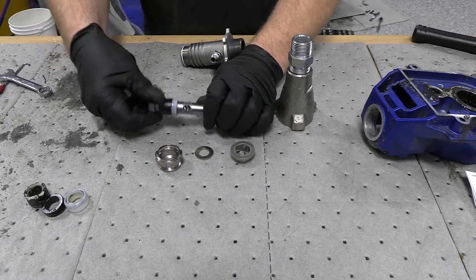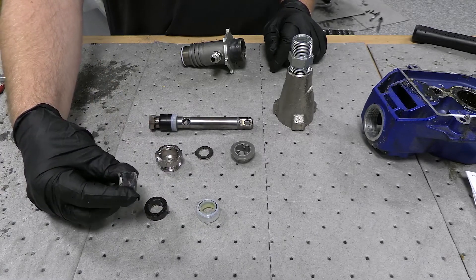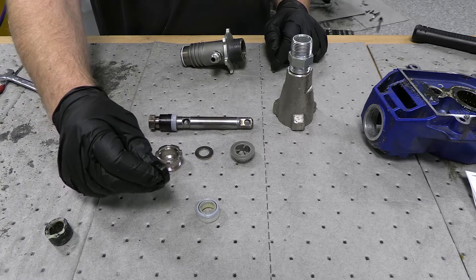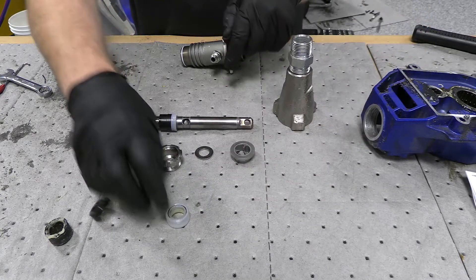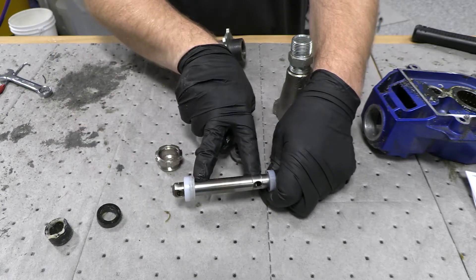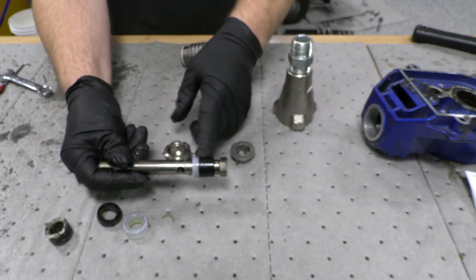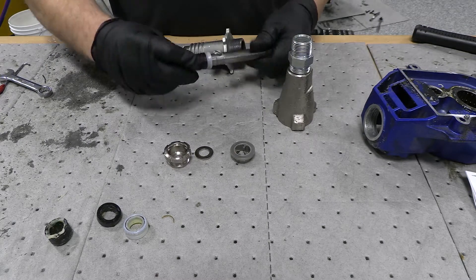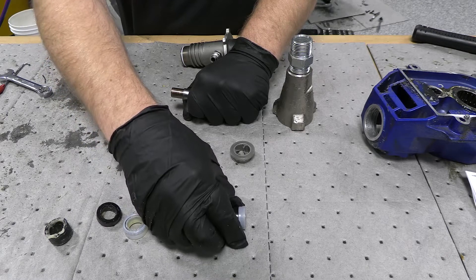Your biggest thing on these pumps is you have to watch how these packings go together. I've already pulled out all of these from the upper. These are the felt pieces — you can see those are not felt anymore, they're not soft at all, they're very, very hardened with ISO. Then you have a spacer that goes up there and then you have the upper U-cup. You can see there's a spring down inside of here. That goes to your pressure side, and there's another one here with a spring — your pressure side. So these set facing each other and your pressure is built in the middle. If you turn one of these around and have it on the wrong way, you're not going to build any pressure, it's going to leak right by it. Keep special note of the order and how these things are stacked on these pumps — you have to put them back the same way. I'm going to set them like that so I know which way they came apart.